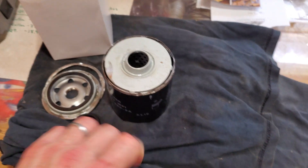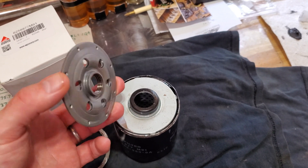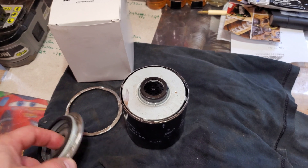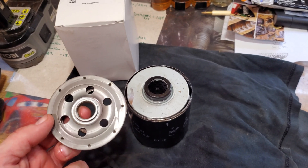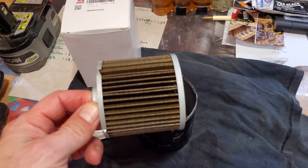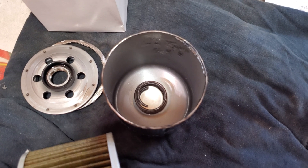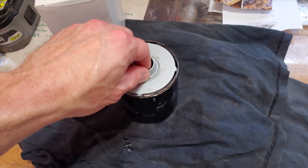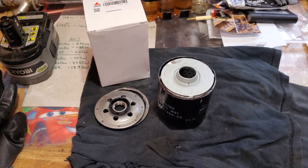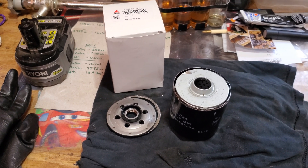I got to be careful — I took my gloves off, it's still a little sharp. But I cut it. Let me kind of reassemble it here. It was a lot thicker where it was crimped — should have cut a little lower. So I finally got it off. You can see the hydraulic filter has no anti-drain back, it just has a seal. And then it has a cartridge filter, which to me looks like it's in pretty good shape. And there's a pressure relief spring in there. I'm not going to cut the filter open the rest of the way and count pleats in this video — I'm going to buy the Wix model and compare them side by side in a future video.